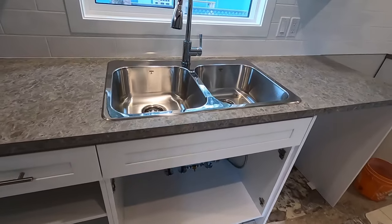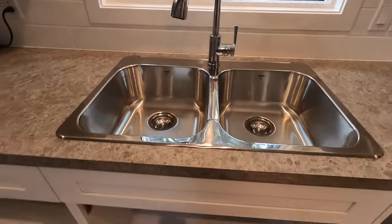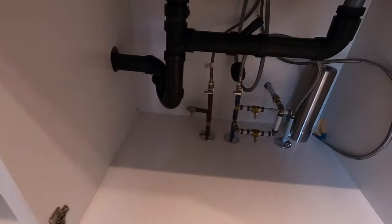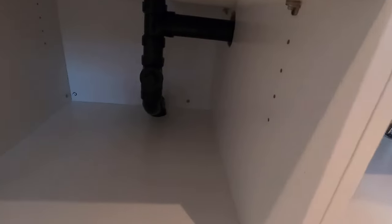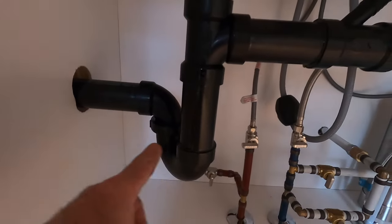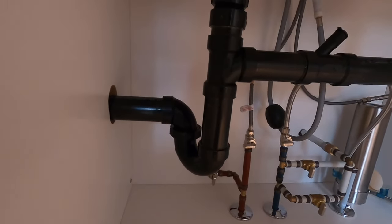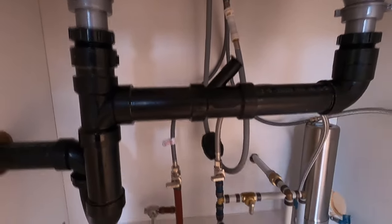So this is how it's kind of finishing up. We've got our sink installed and we've got our gooseneck faucet. Here are the drains, now finished. You can see how this came together — it was a little tricky getting through into the cabinet to connect to the drain. We have the vent up above there. I had to make a little notch in the shelf so the shelf would go back in. Here we have a clean-out, which is important. This is our P-trap — it's called a P-trap because it's shaped like a P. The dishwasher will connect into here when we get to that point.